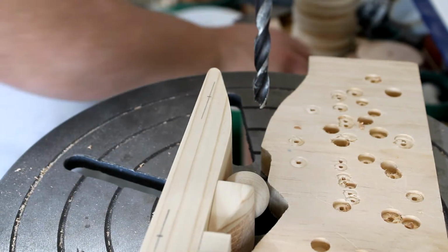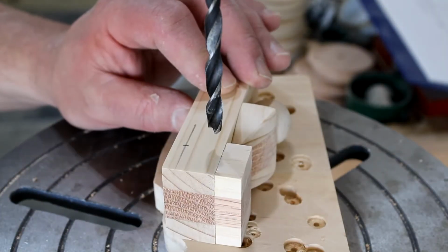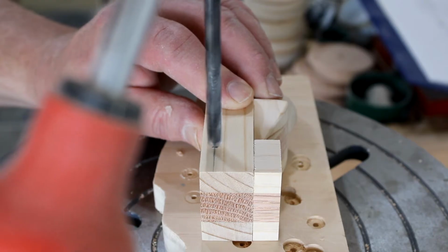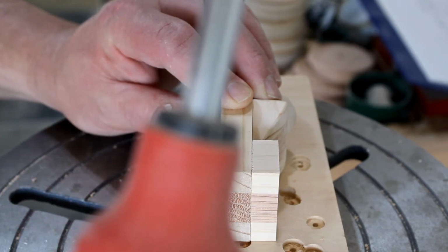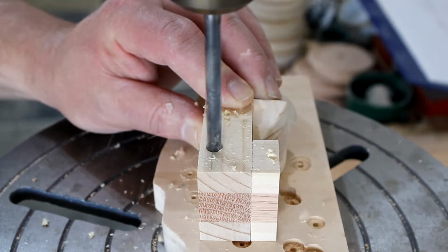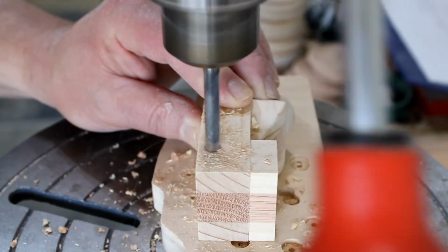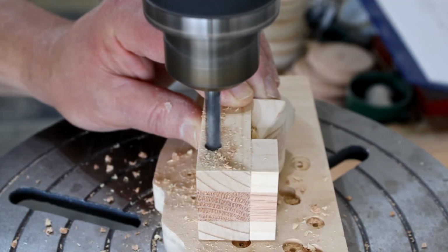Okay, but it's 1/4 inch from the top. And then I forget the exact dimensions from each side, but they're on the pattern below. And just like I said, I like those brad point drill bits. There's the handle of my drill press. Gotta love that. And I like the brad points because you can line up just beautifully right where you need it to go.